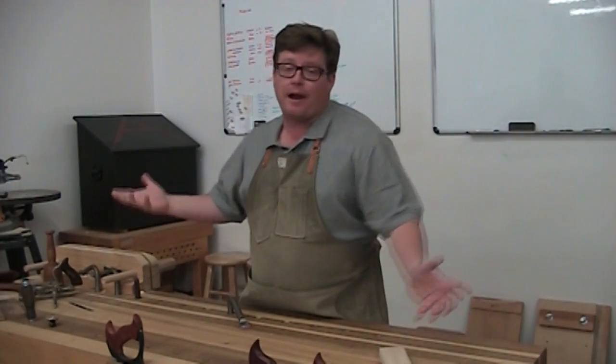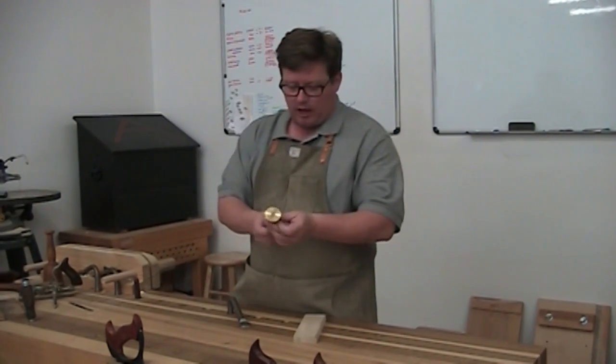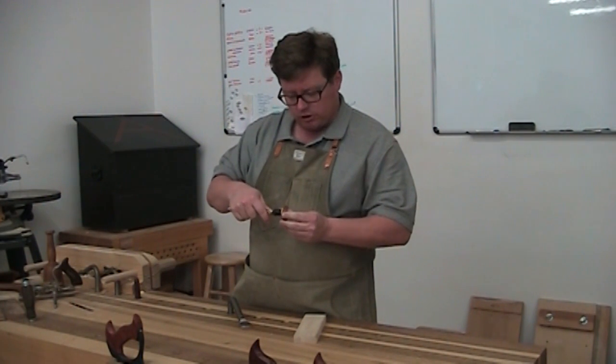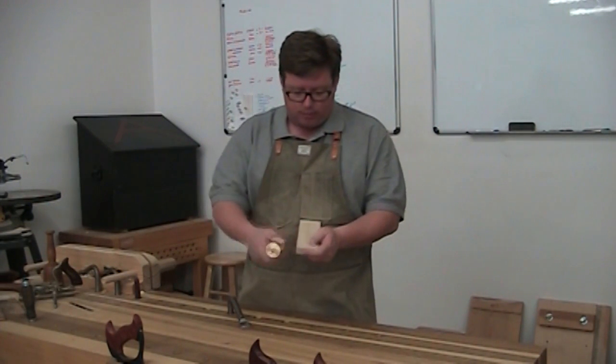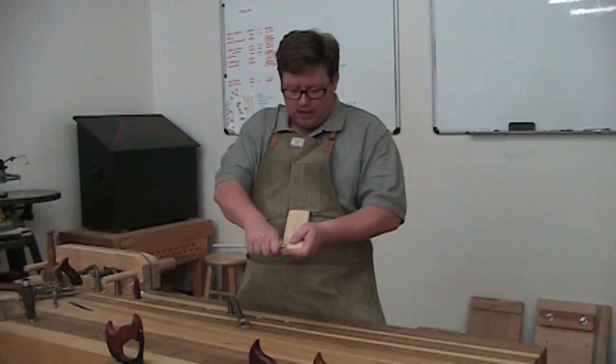You don't even need a power tool to cut them. You can basically just mark out your baseline. I typically would do the show side line first, so I'll go a half inch for a quarter inch groove that has a quarter inch base. Just mark it down with a really heavy knife line. Go heavy.